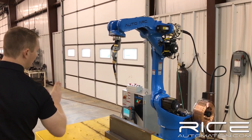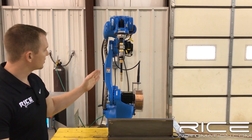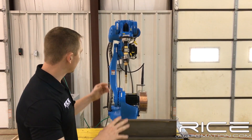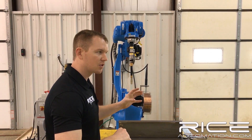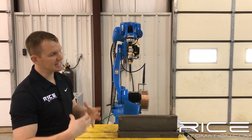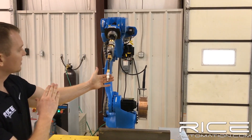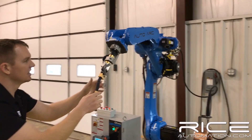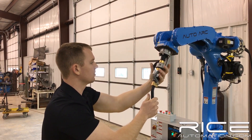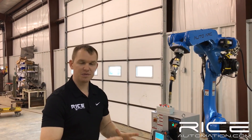The last thing on this robot body is the torch. It does come standard with a breakaway torch. What's great about the robot's mechanics is that upon any kind of crash, when you have a breakaway head, sometimes that head will get stuck and you're fighting it in and out of things with your pendant. What this robot has integrated into the software releases the brakes when the tripped head goes. You can hear those brakes release. It's not just J5 and J6 — even J4 releases, so you can physically grab it and move it and get it out of any kind of collision with your hand.